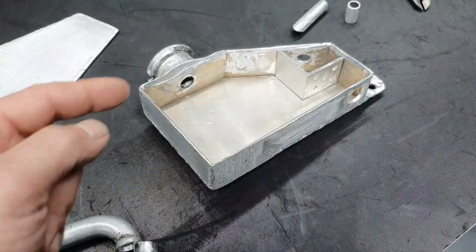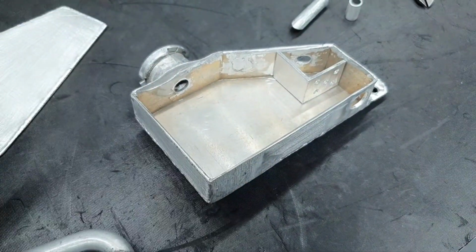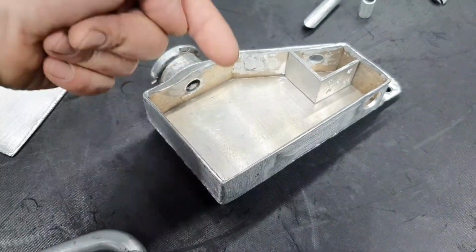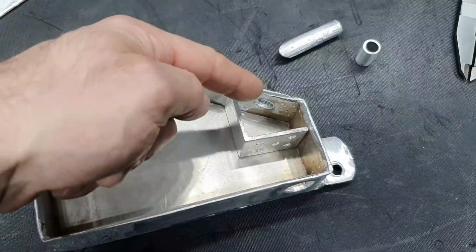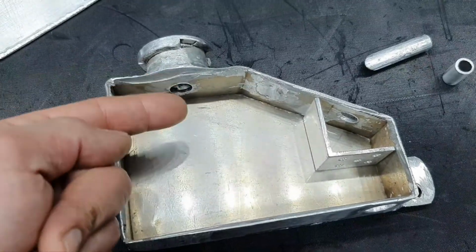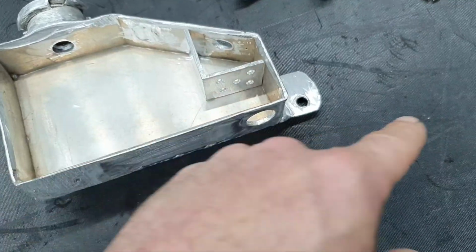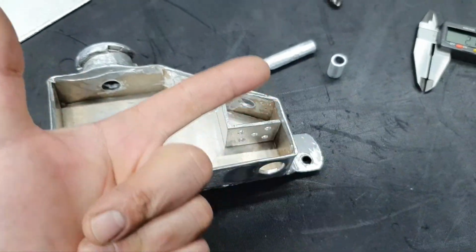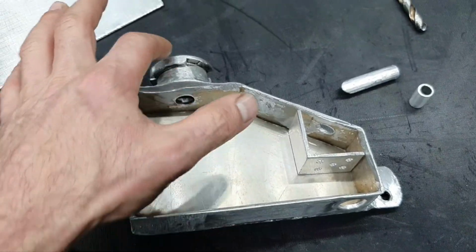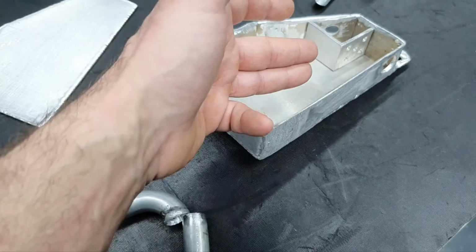Now, there are different types of tanks. The thing is to not create bubbles inside, to not disturb the fluid in such a high position like this one, which starts creating bubbles. You don't want that, because the bubbles are going to be sucked in by the pump, you're going to have a sound, you're going to overheat the fluid, and when you switch off the engine, it's going to start escaping from here up. If you're asking me, it's the design of the tank.